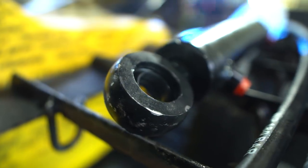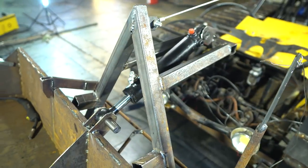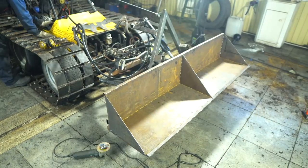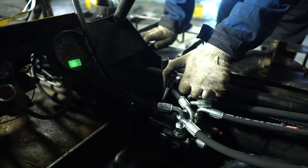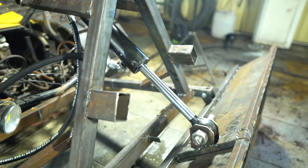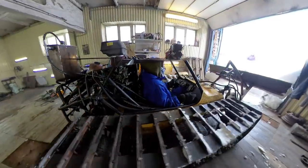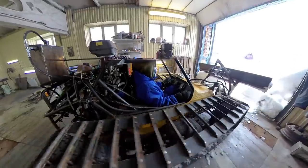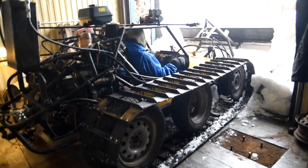The rod length of the cylinder is 400 mm — that's pretty enough. The bucket latches were cut as they are no longer needed. We connected the hoses to the hydraulic cylinder and checked — everything is ready. Time to put on some warm clothes for snow removal and go out to the yard. Everything seemed to work and the power was enough, but that's not how it turned out. I tried to climb the snowdrift without clearing, but the tractor jibbed into the snow and couldn't move further. The engine didn't go deaf but the tracks just stuck.